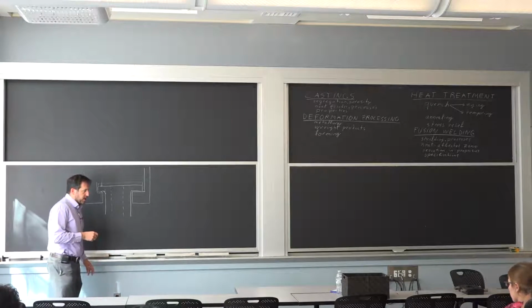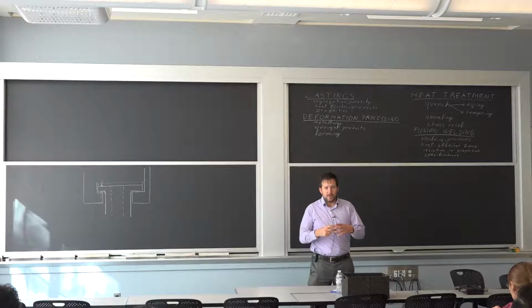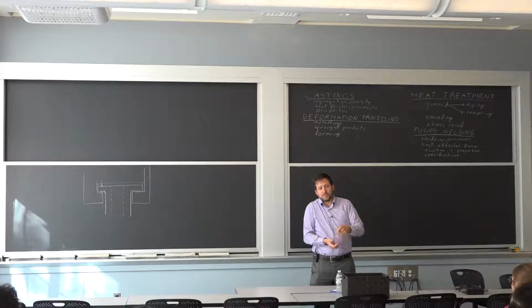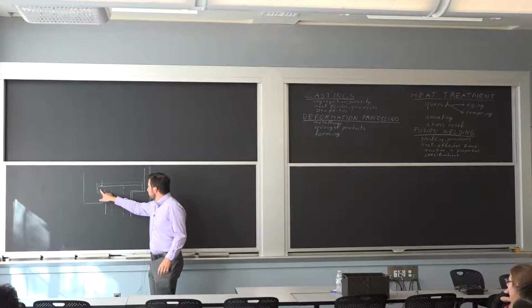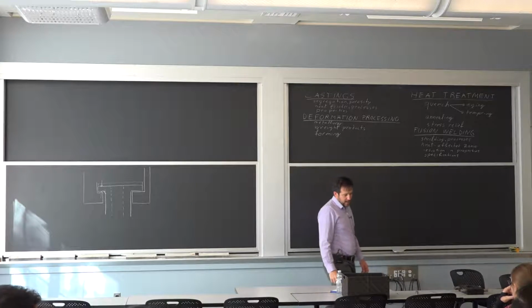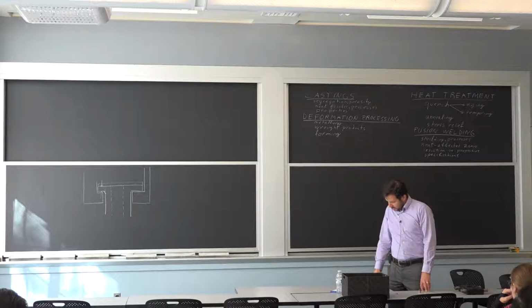I've seen that a lot where if you have a big amount of plastic, like the housing, it's okay that you can come and thread in the fitting, and it's going to just really work in shear. The problem in this case here is the risk for bending and tension from the stress riser. So it's unfortunately typical. I have another example of that later.